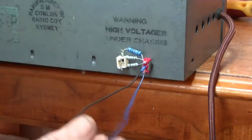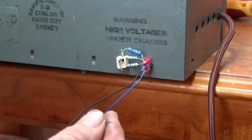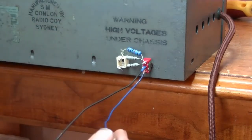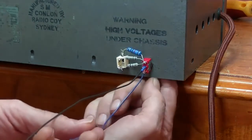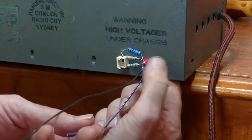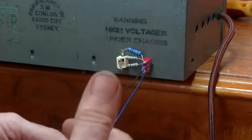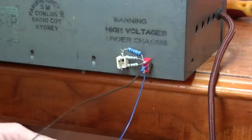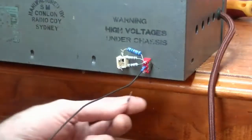The other end will be connected to the input, the high end wire, providing radio signal to the volume pot. And so we're able to then switch between MP3 there, radio there, and of course they both come out of the center terminal, which I call the common terminal. And that's pretty much it. So we'll put this wire in. I haven't done this in a while. I think I've got it right.